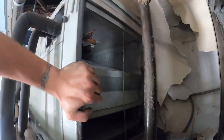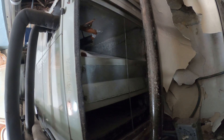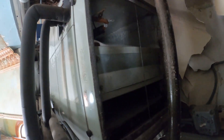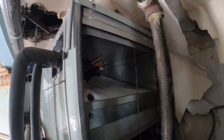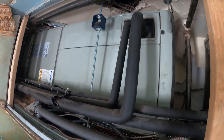I'll turn off the power for the condensing units — I just want to see if I have air movement. If the fan goes bad, you'll ice up. Both fans are running. We've got to let this one on the left defrost because we will not have any proper pressure reading. And we've got to take it from there.